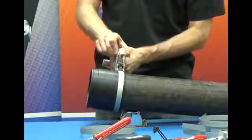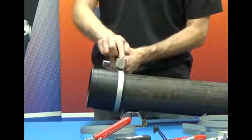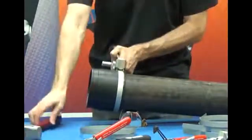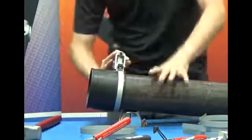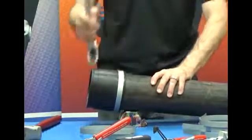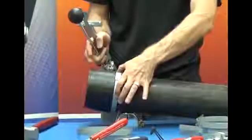And I'm going to set this using a punch. So here's the punch on our tool. I'll grab our FastLock hammer and give it one swift blow. That sets the clamp. Pull the punch out of the way, maneuver the clamp upward, and work it to break the end of the strapping off. Now this clamp is properly applied. There's a punch right in the center, and it's tight.